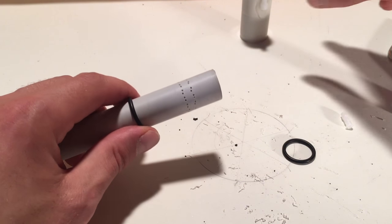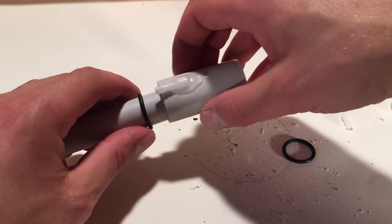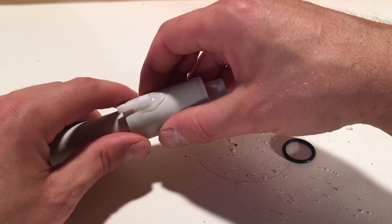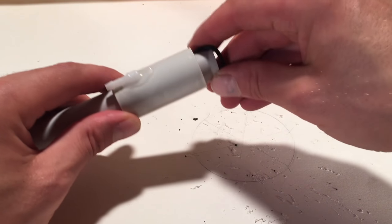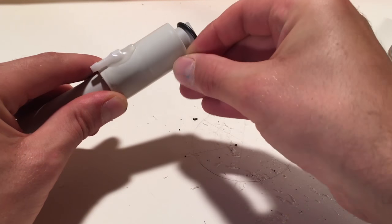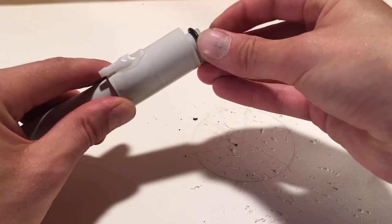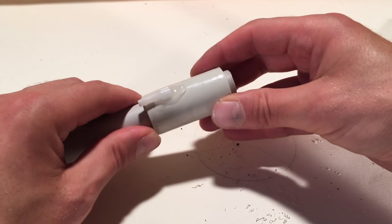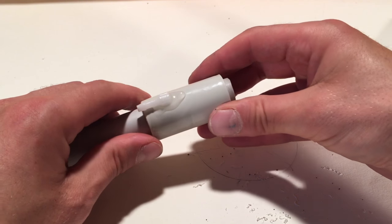After drying, the first sealing ring is placed on the riser pipe. The plastic tube is pushed over the sealing ring and so far upwards until you see the holes in the riser. Now the second sealing ring is placed. Between our sealing rings is formed our pressure chamber.